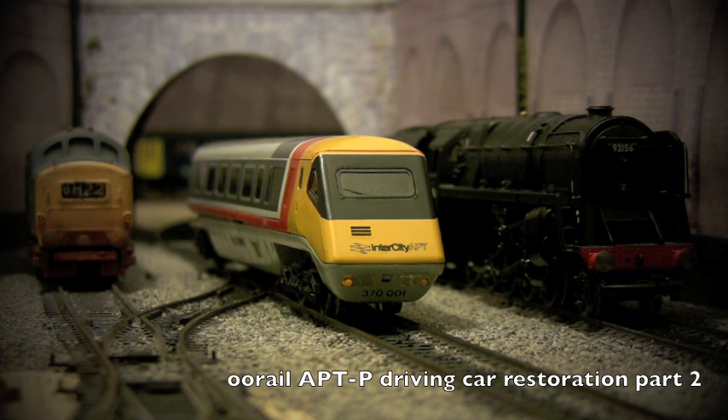Unfortunately LEDs are the best way to do it, but white LEDs are just too white, so we went with a yellow LED and as you can see it's lit pretty well. I used a 220 ohm resistor, however I'd suggest using something a little smaller, maybe a 100 ohm resistor, just to allow the light to come off a little better with the yellow. It's a little dimmer than it probably should be, but overall it works pretty well. Once the power on the transformer hits about 10 percent the light comes on and stays pretty consistent through the range.